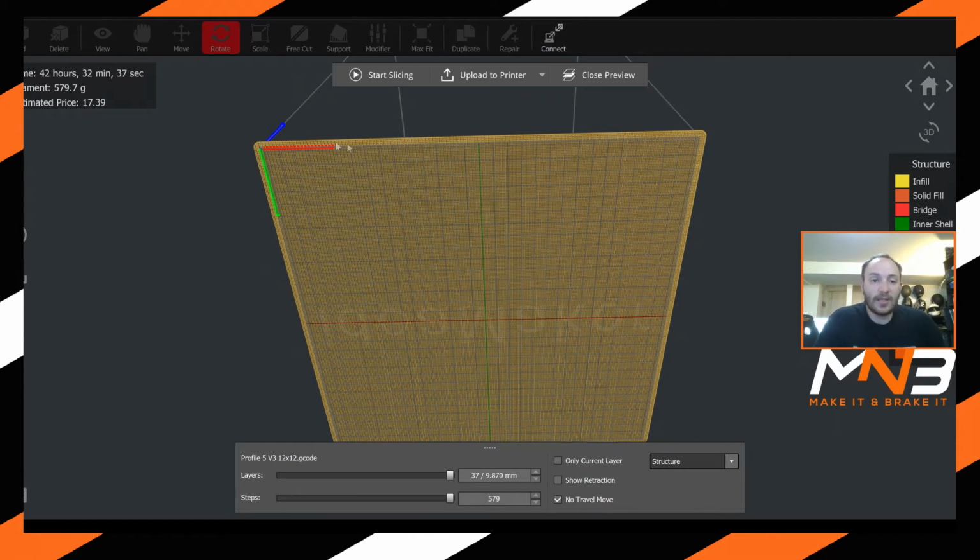But you can see this light yellow piece up here extends well past the edge of the build volume. On a lot of printers or a lot of slicers, they will interpret this as the edge of your build volume, but sometimes they will try and print these layers anyway. So what we were seeing is on the edges here, as it was tracing out the edge of this raft, we would get 3 to 4 layers on some of these edges, where it would just go back over trying to reprint all of these layers